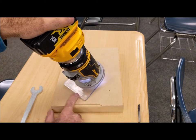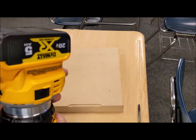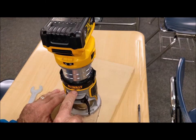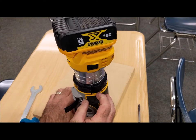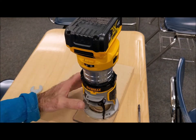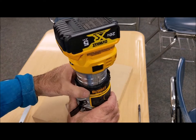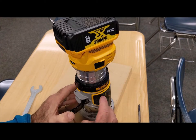What I really like is this plastic plate add-on. And then we also have this micro adjustment, which is really very clever. You're going to zero it out — let's say it's just touching wherever you want. Then you take this micro yellow ring right here and line up the zero on that tick mark. There's a little tab on it, so I'm going to bring that tab over to the DeWalt logo — that's zero. Every one of those tick marks is a 64th. So if I want to bring it up or down, that would be 1/64th. Right there is 1/16th, and one-eighth. You can see the bit is now at one-eighth of an inch.